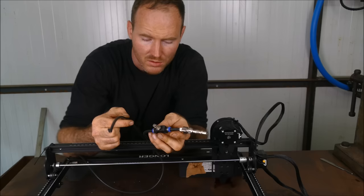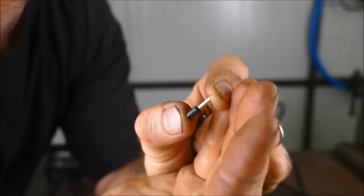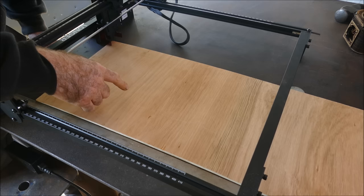I had to add air assist. I used a quarter-inch hose from my compressor, reduced to 20 psi. With a simple cable strap I made a little nozzle from an electrical ferrule — I use these all the time for tidying up the ends of cables, and it turned out it made the perfect nozzle. Simply bent over and taped onto the laser nozzle — it literally took me less than five minutes to create.